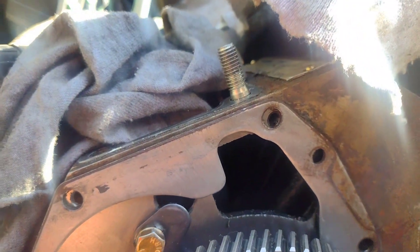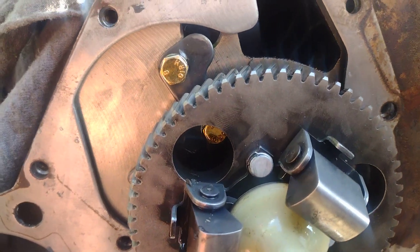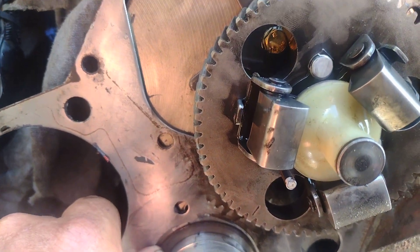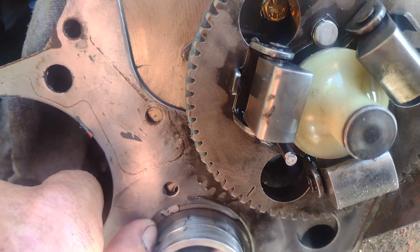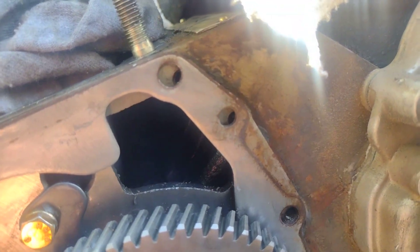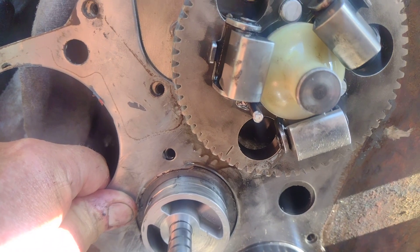See — when you line up the bolts, look, they don't line up. So if you force it over like this, which most people would do because they don't know, and tighten it up, it's not going to close the gap in here — it's going to stay open. You have to turn this clip all the way... there's an ear on there. Look — boom, bingo — now it's lined up and it's tight against the block.